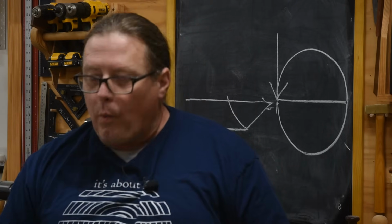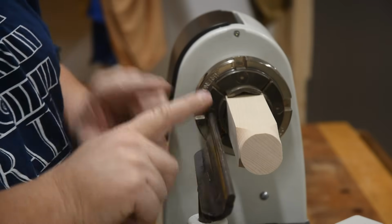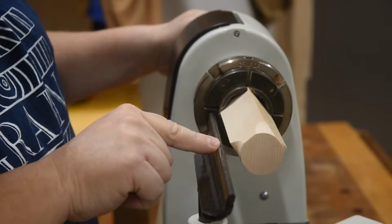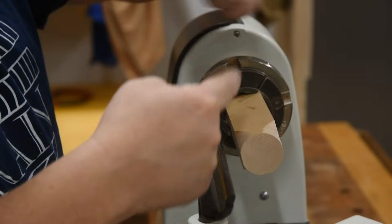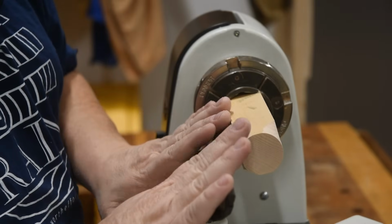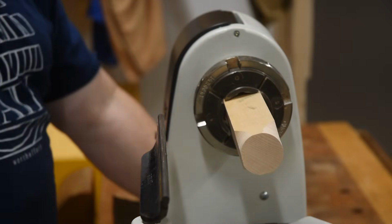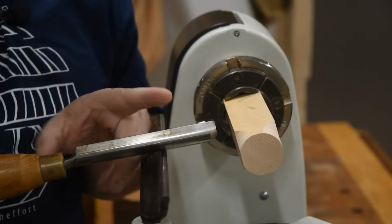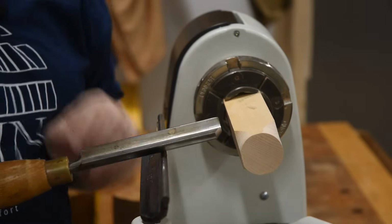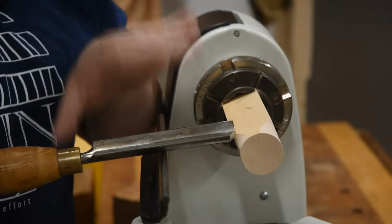That dictates where our tool rest is going to be. So right now, my tool rest is the proper distance from my work. And notice I can spin it around, and there's a slight air gap over it. When you're spinning bigger stuff, as you knock away the corners, you'll have to bring the tool rest closer and closer in. If I was way out here when I was turning, all of a sudden, all my leverage advantage has gone away. Now it's quite a bit, so each rotation as it hits this is transferring more of that 1 horsepower to the tool.